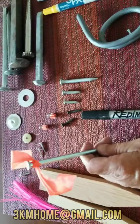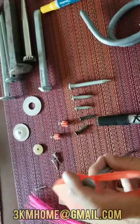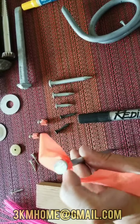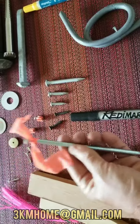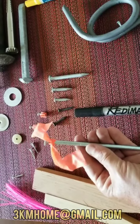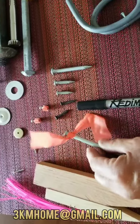60D nails are probably what we use the most. Basically anywhere on this nail it'll be plus or minus a couple of hundredths. As long as you can get it in the ground and it holds a grade, it's fine — and you don't have to carry a hub bag anymore.